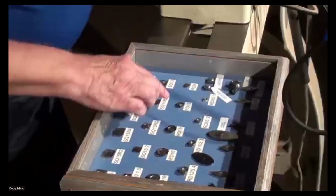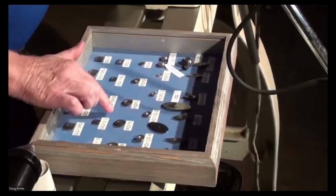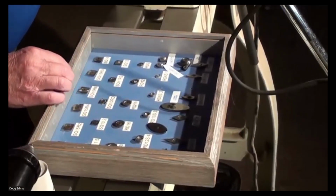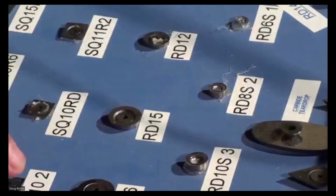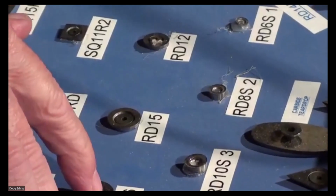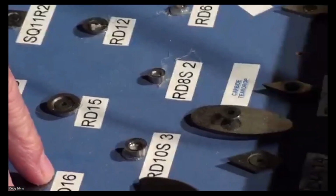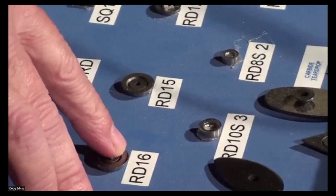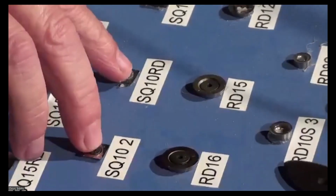Now, flat top cutters, again, round. We go from 18 to 9 millimeter. These are flat tops, again, all of them polished. I don't know if they look it there, but they are. The larger squares and the larger round are 832 screws. And they are Allen wrench screws. The smaller cutters are 440 screws.